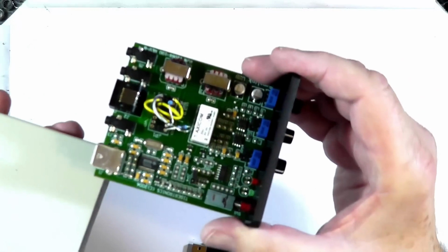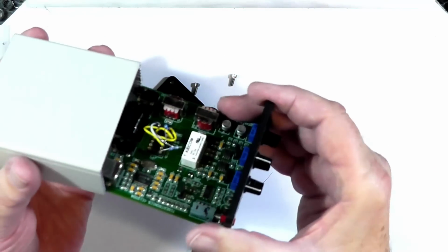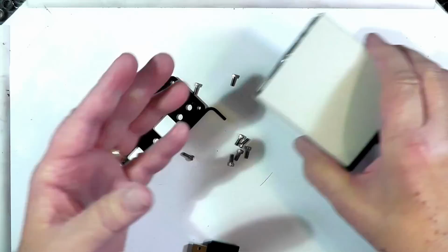Okay, now you could add to this if you want. Add the isolation transformers, okay. You're going to have to put in some sort of a circuit to create push-to-talk. And computers no longer have the RS-232 output. So that becomes a little bit more of a problem getting push-to-talk. And that's where something like this comes into play, because it develops the push-to-talk from the sound right here. Like I said, this is made very specifically for ham radio.